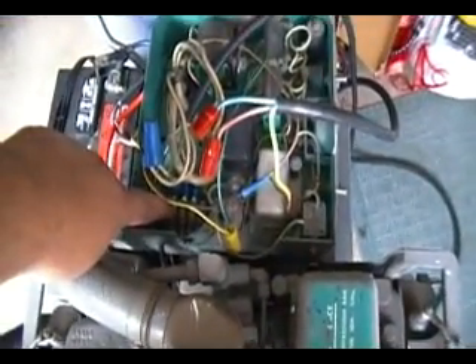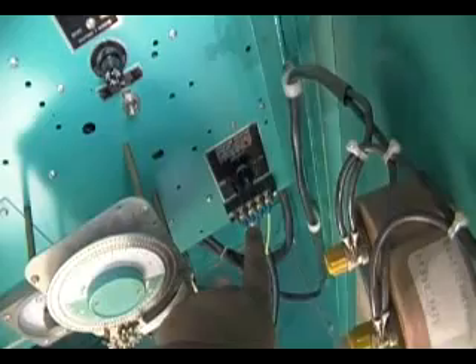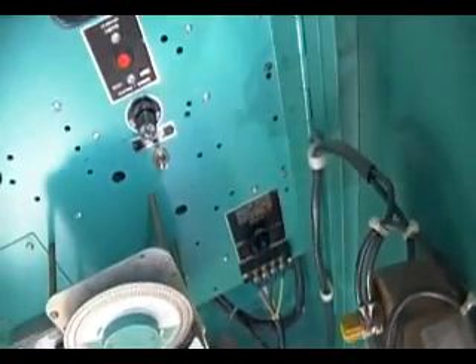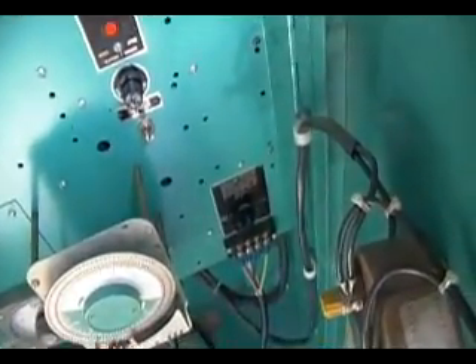What I have going on here is these four connections down in here are B positive, one, two, and three — these four little screw connections. I have those hooked up to this four-conductor wire, which goes into this panel, and down here is where they go. That works the remote control for the generator: start, stop, battery charging, and whatnot.